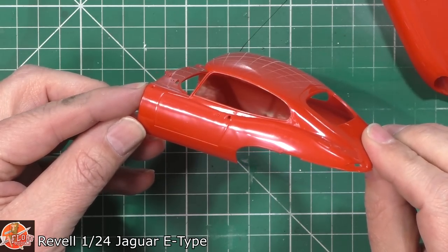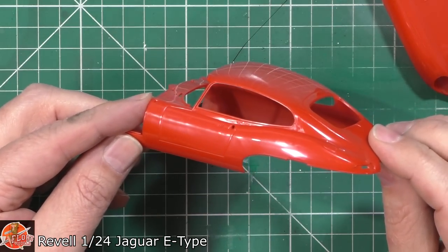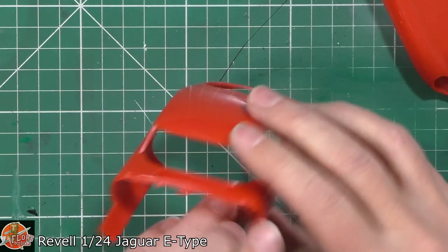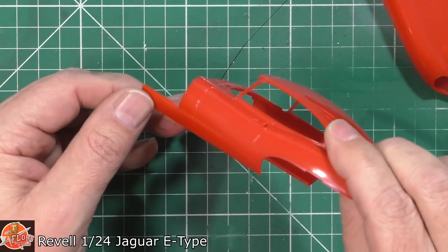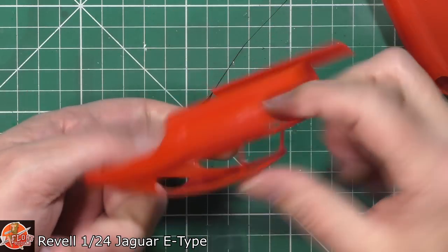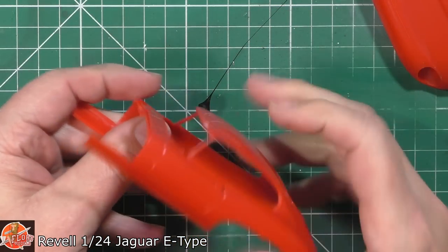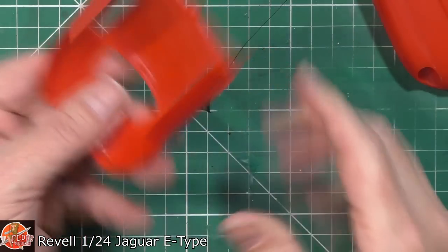Can you see this sort of ripple running down the side? The real thing's got those ripples as well, but it's not what I was expecting to see. You can physically feel it when you run your finger down — I can actually feel those ripples, which is an interesting thing. This side's definitely got something going on and there's no reason for it — nothing moulded on the inside giving that effect. But generally it's quite nice, no sink marks that I can see. Good solid, quite chunky plastic — hard plastic, not soft.